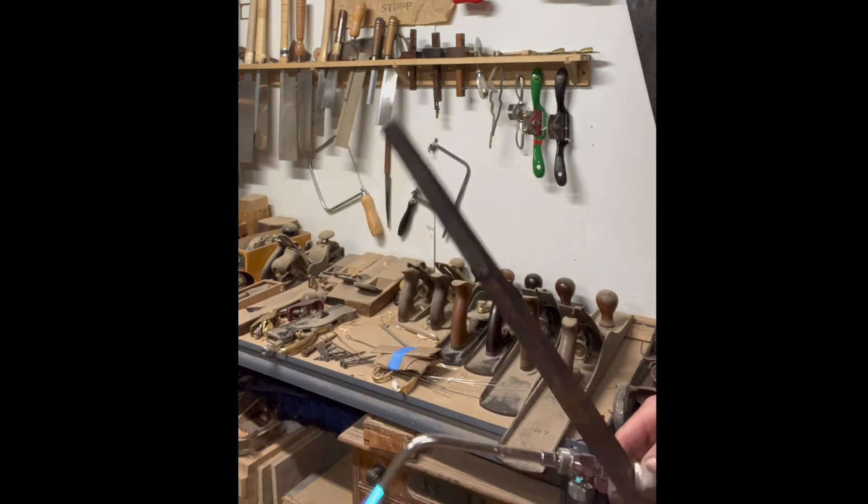It's starting to get hot, and now you're going to see why we're doing this in the dark. I don't know if you can see, but the end of that is just glowing — and that's what you want. You want it to be just barely glowing. Look, if I turn the lights on you can't see that it's glowing. That's why I've been doing it in the dark — because it just needs to be the dullest cherry red.